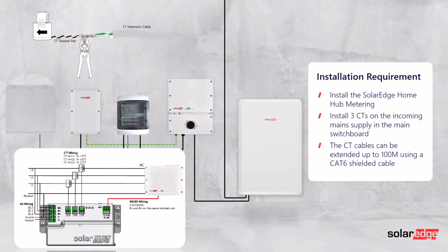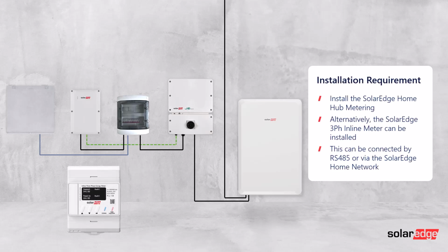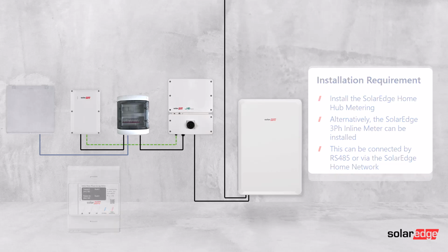And as normal, you need to connect the CTs on the main incoming supply, that's the incoming supply from the grid to the main switchboard, and ensure that if you need to extend them, use a Cat6 cable. Alternatively, you can just use the inline meter and connect that either through RS485 or via the SolarEdge home network.